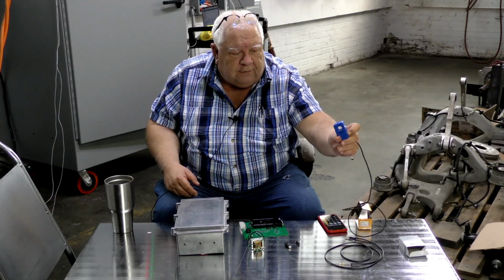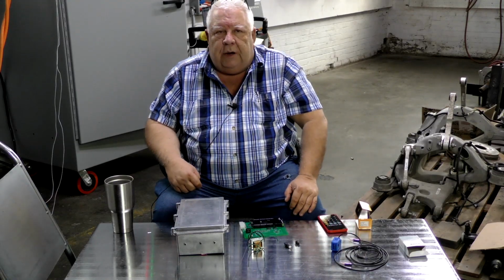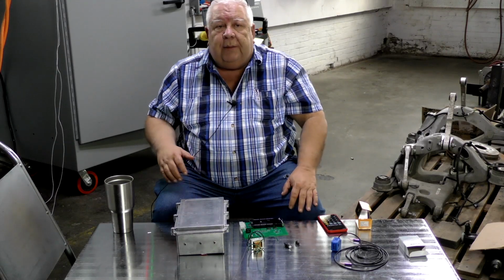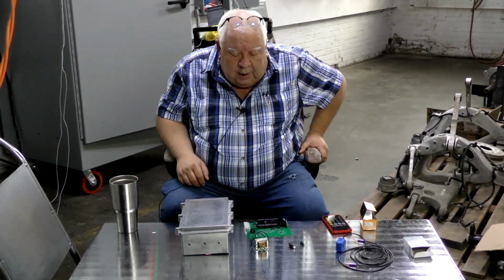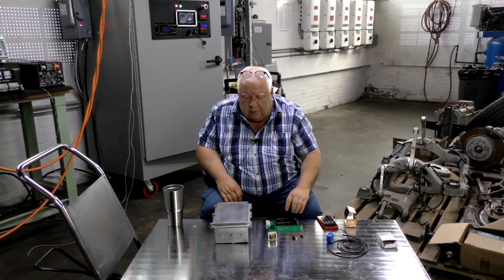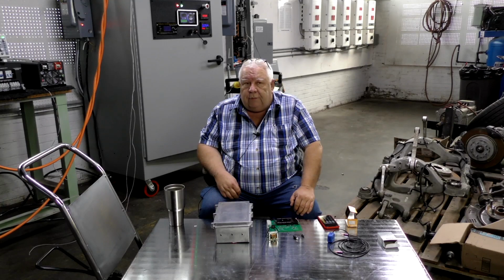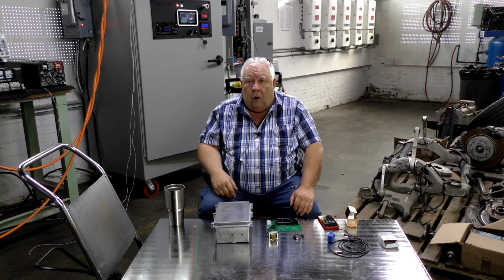But as you can see, the size of the cable you could put this around would not be capable of any more than that anyway. So it's a ratio, 100 amps to 50 milliamps. If you have 10 amps, you have 5 milliamps of current output. And so this is how we're going to measure power. And with this chip and what we know about power factor and phase angles, we can not only calculate the true or active power and frequency, but we can tell its direction. We can put a sign on it.